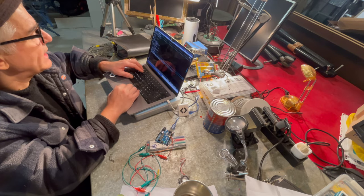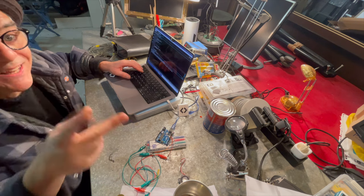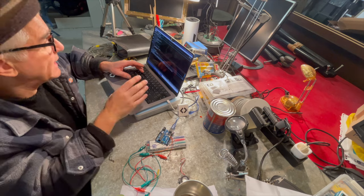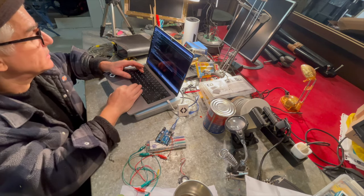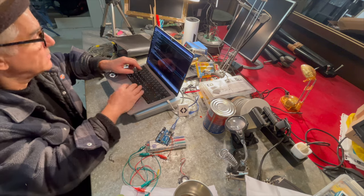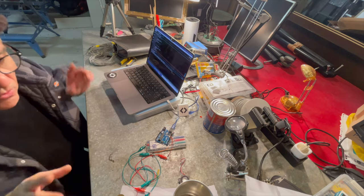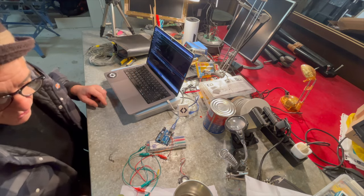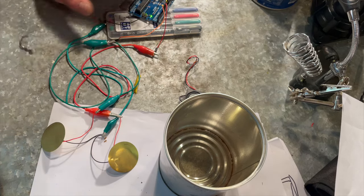So I'm going to set up a channel and just oscillate the channel number, saying play a note on a particular channel, being whichever pin I want. Cool, so this will just oscillate between the two channels, and I should be able to hear the sound moving backwards and forwards between the two. Awesome.